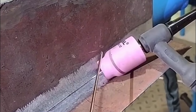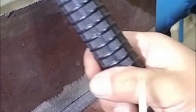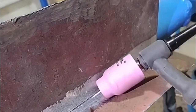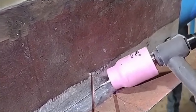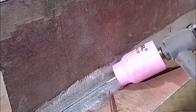Today I will share a relatively simple technique: the zigzag welding target. It mainly uses our wrists to twist left and right, using two fulcrums to alternately roll forward and back on both sides, requiring alternating up and down, back and forth motion. If the amplitude is large, the weld beads will be large and the lines wide; otherwise, they will be smaller.